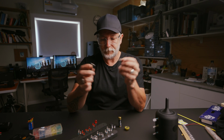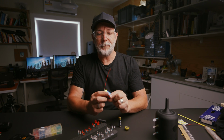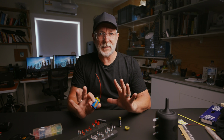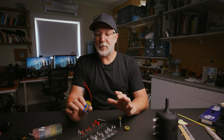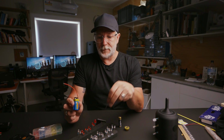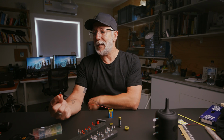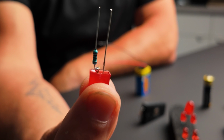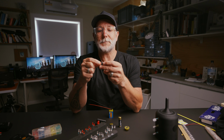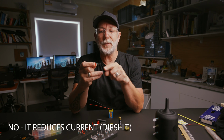No problem at all. However, as soon as you start applying more voltage, so this is a 9-volt battery, and you can go and discover all the technical aspects of this, but if I take this 9-volt battery and I attach it to these legs on this LED with no protection, it will blow up the LED. I'm not going to get into that why. So what we do is, every LED that I have ever connected to a light painting tool has a resistor on there. And resistance basically reduces the amount of voltage or varies the amount of voltage that goes through the LED.